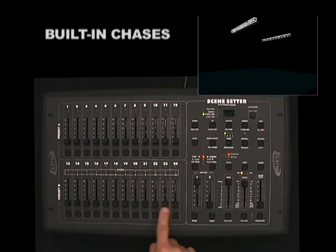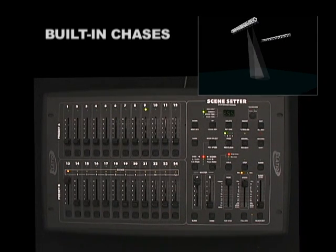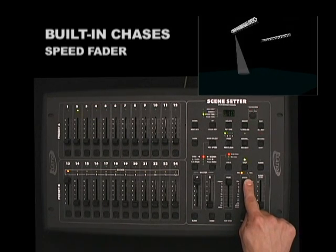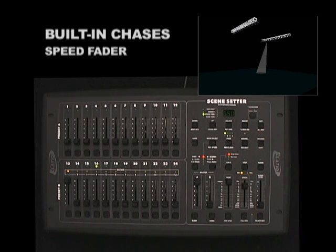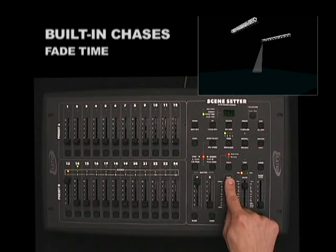Using the preset B faders, select a desired chase. Playback will begin immediately. You can adjust the chase rate at any time by adjusting the speed fader or pressing the tap sync. You can also incorporate a fade time between the chase steps by adjusting the fade time fader.